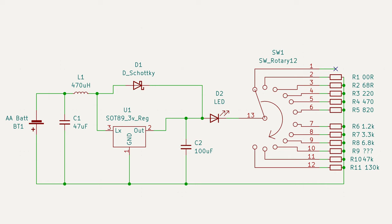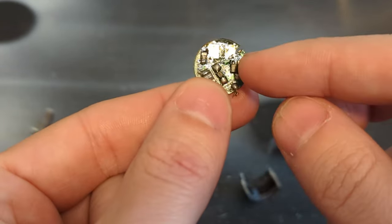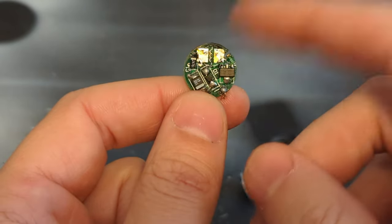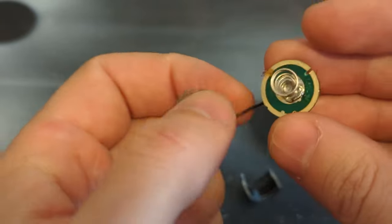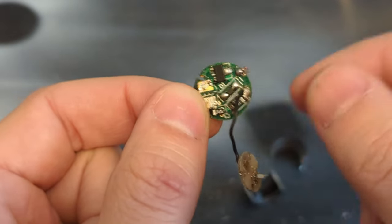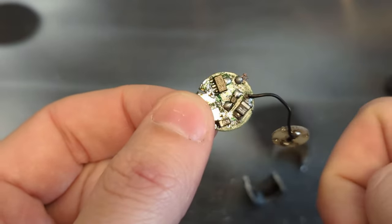That runs off to the other side of the LED, so as you're selecting different resistors, it's dimming or brightening your LED. The whole voltage system here is five components — the most expensive one maybe 10 to 15 cents for that chip. All this stuff is pretty straightforward. I couldn't find the exact little boost regulator they're using, but I found several with the exact same reference setup — this looks just like it came right off a datasheet for one of these little regulators.